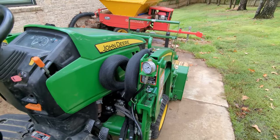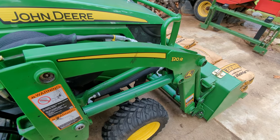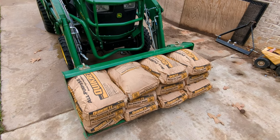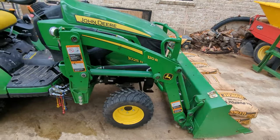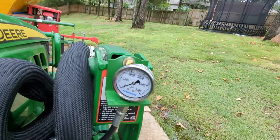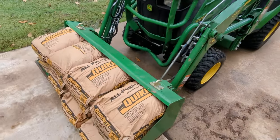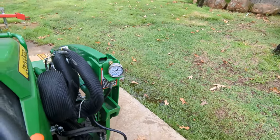You can go through the math with these 1.75-inch lift cylinders and try to figure things out, but the simplest way is to have a known capacity in the front. This is 12 bags of sand at 70 pounds each, so that's 840 pounds — they are wet so maybe 850 to 900 pounds. I've already done this without the load: the loader by itself reads 200 psi. I lift it to what I call my 'weight height' — it doesn't matter what height that is, you just use that same height every time. 200 psi empty — let's start it up.